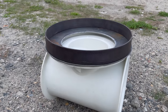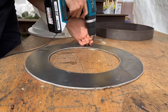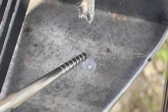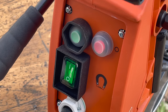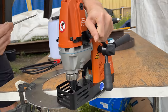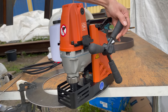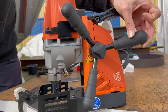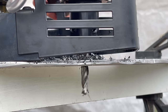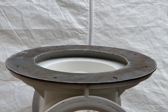Next, I'm going to drill some holes into the disc I made for the stern adapter. For this, I got a spiral drill bit that fits into my magnetic core drill. Now this drill bit doesn't have a hole in the center, so I'm going to have to lubricate the cut manually. Let's see if all the bolts fit.